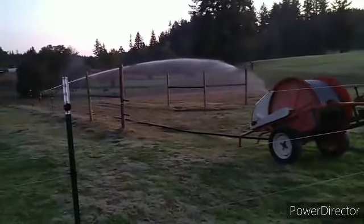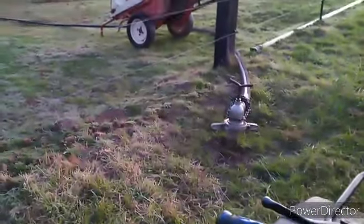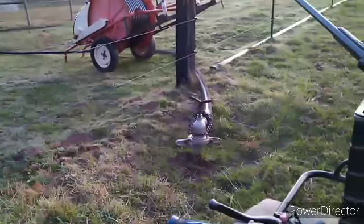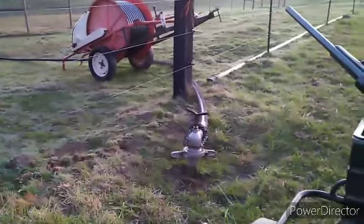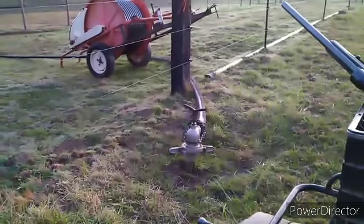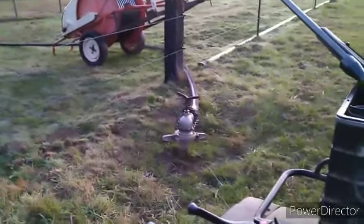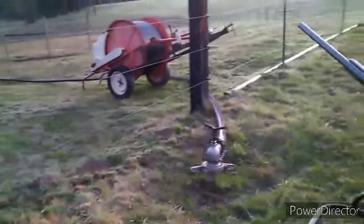That's where that one was when I shut it off in the dark last night. When that gets in, I'm going to take that opener in and see if I can repack it. I'm going to put it in a vise to get it apart — I tried doing it up here once and couldn't get it apart. Right now the shaft is shoved all the way up. The valve's only open two-thirds or three-quarters of a turn, but the pressure's got the shaft shoved up, which is blocking it from leaking like a sieve. But as soon as you push it down, it's sprayed everywhere. See if I can rectify that situation.